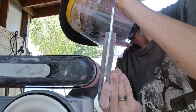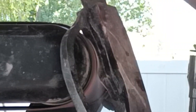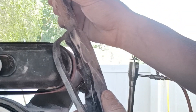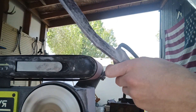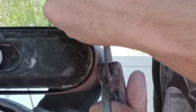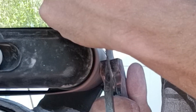I've gone ahead and changed the layout of my grinder so I can get into the nice corners and make really nice contours for the fingers on the handle without too much fuss, because that rat-tail guard does tend to get in the way. Now that the contours are knocked in, we're going to thin up where the handle heads towards the blade to make that transition smoother, so it's not so blocky at the top.